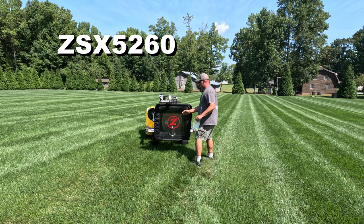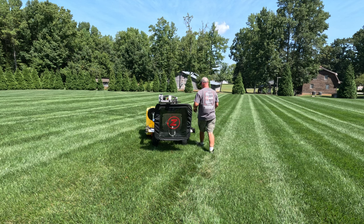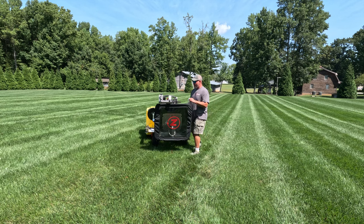As you see here, you can dump the hopper, or clean out the hopper. You have a ton of room now to do your oil changes, filter changes, plug changes, whatever maintenance you have to do in this area. With the new hopper design for 2023, you have stainless steel rods, no cables. You have adjustability right here on your hopper gate, and your controls for your edging, the on and off control. Everything is stainless steel. The complete frame is stainless steel.